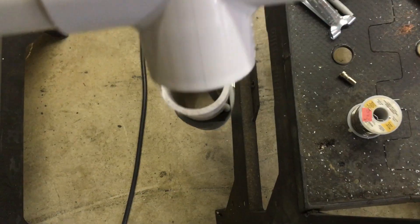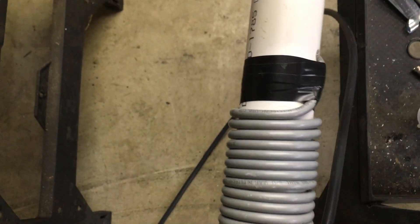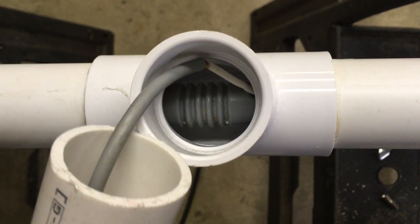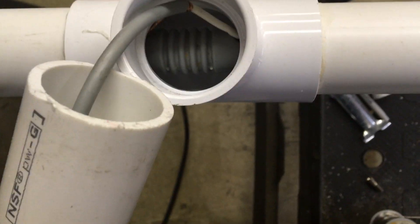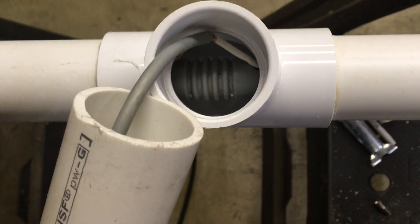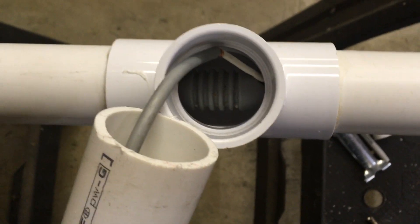What I've done here is I wound the balun to isolate the RF off the line using RG-8X. And if you look down inside the cable, you can see what's commonly referred to as a dog bone insulator. After I did that, I thought I could have just used a piece of the PVC that I cut off of the initial antenna as I built it.